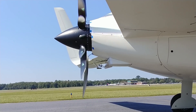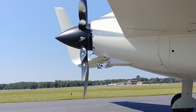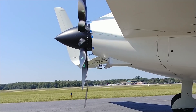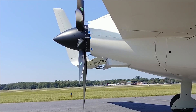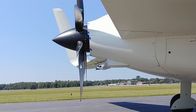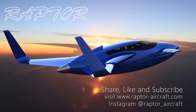The lip mod may be making a difference, but I really need to do more runs down the runway to see if it actually improves cooling — more flow running through the engine. If it's not making a difference, it's just a waste of time. I'm just experimenting with everything I can to get better cooling through the cowling. Still got more work to do on that, and that's what you'll be seeing in the next video. That's the update for this week — thanks for tuning in and we'll see you on the next one. Cheers.